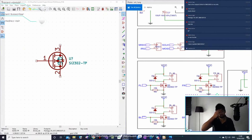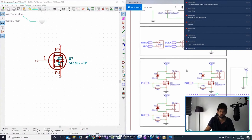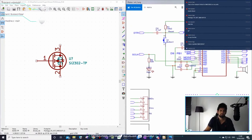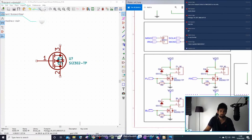I want to explain why you can't control a motor directly from a Raspberry Pi or ESP32. That's why we're using the MOSFET. The ESP32 or Raspberry Pi - whatever controller - only controls the switching of the MOSFET, but the power is supplied by the battery, not by the chip itself. A chip like this can only do 20 to 40 milliamps depending on the chip. So this is why we use MOSFETs - the MOSFET is only switching on and off; it doesn't supply power. It's like having a toggle switch - you're just switching on and off.